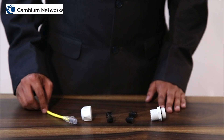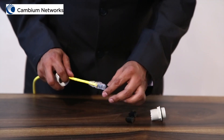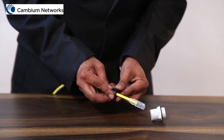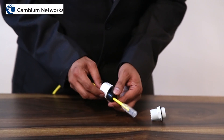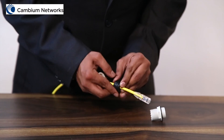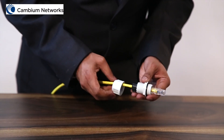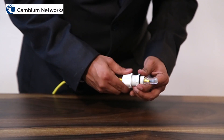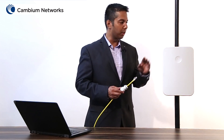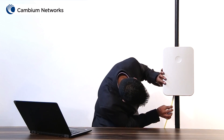Now let's take a look at how to assemble these parts with the ethernet cable. First, pass the ethernet cable through the cap and the plastic cover. After that, insert the two parts of the seal over the ethernet cable and insert it into the plastic cover. Then insert the seal into the body by passing the body through the ethernet cable, and connect the cap with the body firmly. After the cable gland is assembled with the ethernet cable, connect this ethernet cable into the main port of this access point to provide connectivity, and lock the cable gland into its position with the access point.